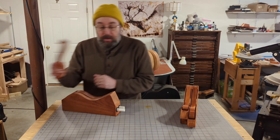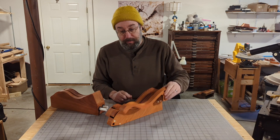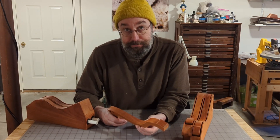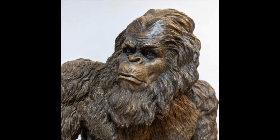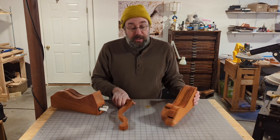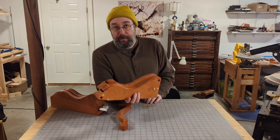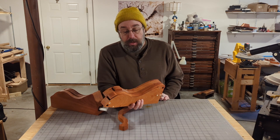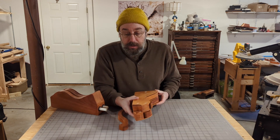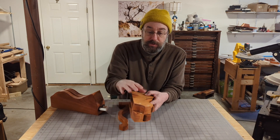The drum itself looks like this. We really wanted to have this raised area here so that when the sides come in, you have access to the drum — it'll stick above the side. This is going to float inside the guitar. This is not going to touch the side. It's just going to be kind of suspended in there by the head block and a brace on the side. It's also worth noting that the braces — front, top, and back — are not going to touch these either, because that would screw everything up.